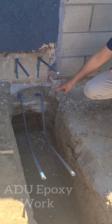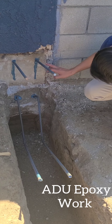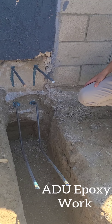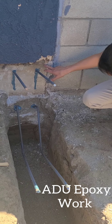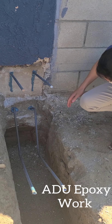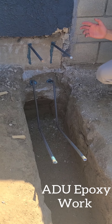This is like 20 inches of footing here. They did a lot of foundation work here. Yeah, this is old school stuff right here. This is really good — we could trust them. I thought it's not enough, but that's good enough, because you only need 12 and this looks pretty long. So they're going to do this, and that's it — you're good to go.